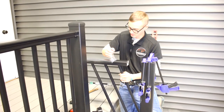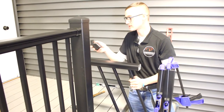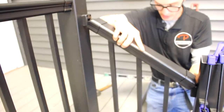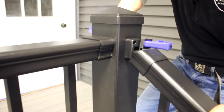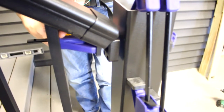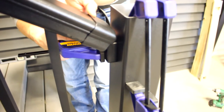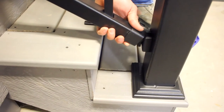At this time, go ahead and peel off the protective film on the top rail, then slip the brackets on. With the top brackets, the stair post mount should be in the up position — slide that in between the posts. You might need a little bit of racking to make sure it fits. Once in between the posts, get it up to height and throw a clamp on the top stair post mount. When clamping, the easiest way is to get the clamp on the post mount covering just one hole, so you still have access to that screw hole to attach it to the post. Sometimes you might need a little adjustment — pulling the bottom rail slightly or pushing the bracket to the post — there's a little wiggle room.